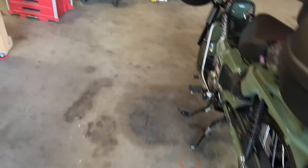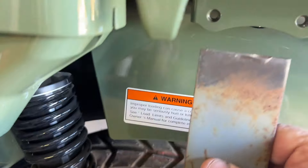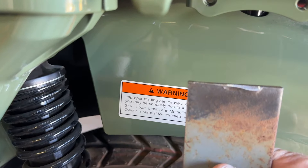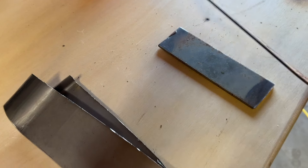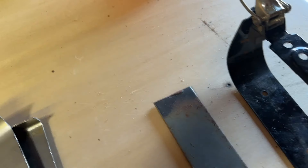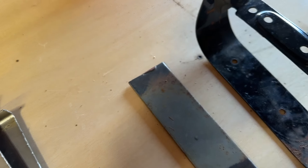I've got a piece of scrap steel here that I'm going to use, and I've got the tool kit off. The unnecessary tool kit is in my back pouch here, so I still have it. We're going to mount that right there. It's pretty heavy, so I might lighten it up a bit, but we're going to run a T across there, weld that, and then drill the holes for that. That'll be the bracket that holds the fuel container. I'm using this older bracket as a pattern, but I'll be able to adjust accordingly. I need another piece of this — a small stock to put across there to get that torque and bolt on.